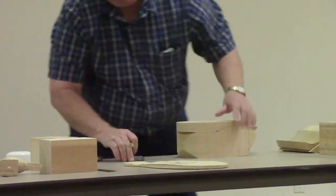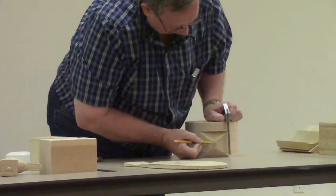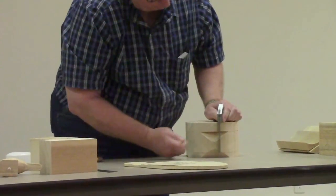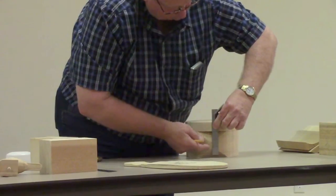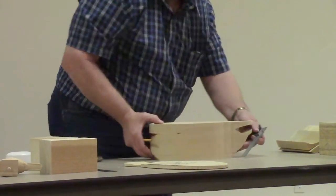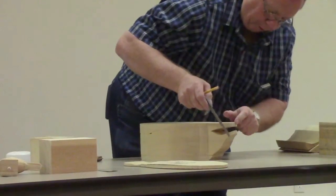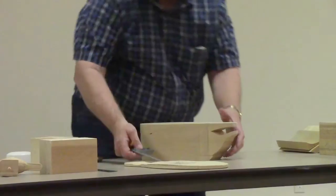So at this point, I like to take the square, make sure we're lined up here, and I like to get that center line reestablished. I guess I did this one the other day just to save a little time. So again, if I'm square to the world, I'm getting my center back where it belongs. Kind of a small surface to work with, but the same thing, I'll chase my center from this top layout block. I'll get that on the tail piece, okay?